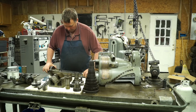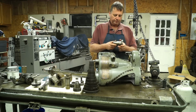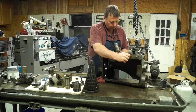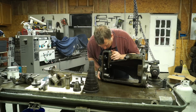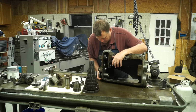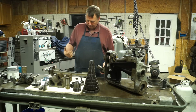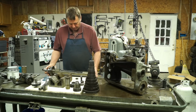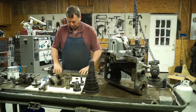during the video, you saw me take the screws out of this flange. Well, when you look inside, let me turn this around. When you look inside here, this went into this housing right here, okay? And when you look inside here, it doesn't look like anything is there for it to push out. Well, basically, what it does is this bearing surface captures the shaft on this side, okay? And by those 2 pieces being bolted in, they capture the whole assembly here.